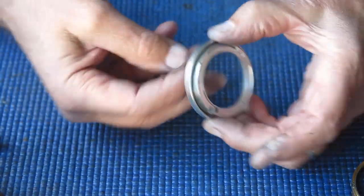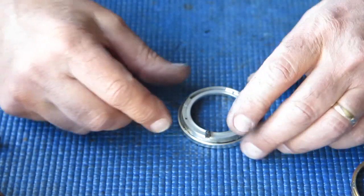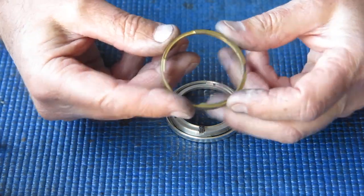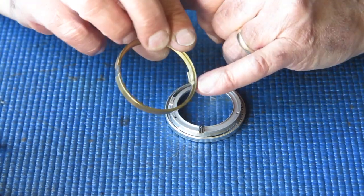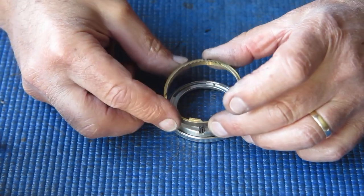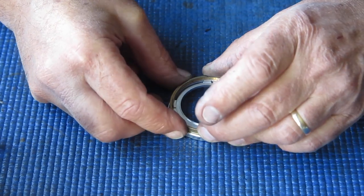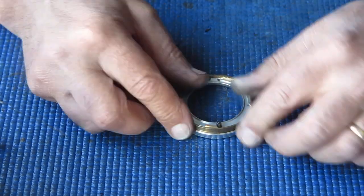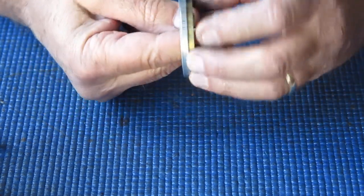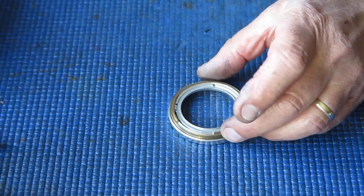If that felt rough, I'd lubricate it with a bit of graphite powder and then blow the powder out completely. The brass ring. There's a little notch, a little cutout in here which has to go over this pinion, otherwise you'll never get it on. This often doesn't want to go on easily. It's in place now. And it has to line up